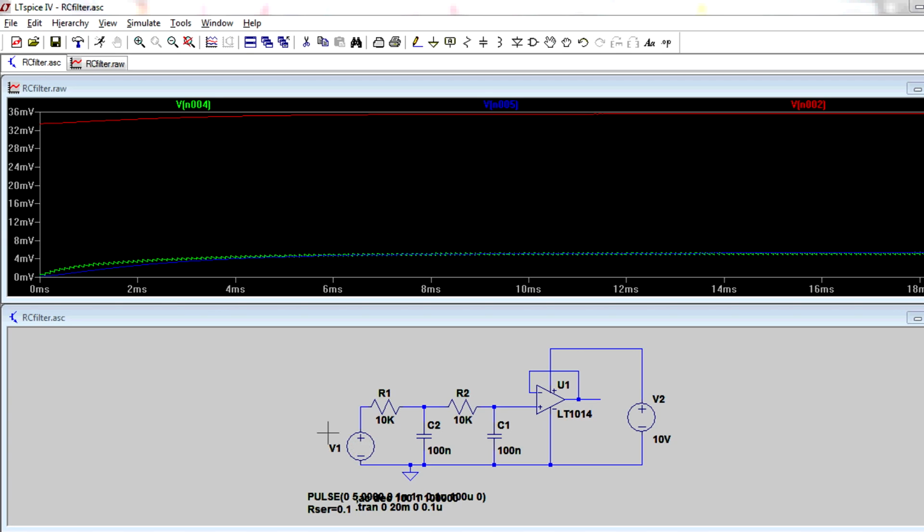So you might think that the solution to this PWM thing and the trade-off versus the response time versus the attenuation and the ripple and all that sort of stuff is to just up the frequency of your PWM signal. Well, yeah, in theory, that's great. The higher the PWM frequency you use, the easier it is to filter out with better response time. But the microcontroller is going to have a limit to how high a PWM frequency it can go based on the resolution. And generally, you can change the resolution of these things. You might be able to use it as an 8-bit one or as a 10-bit one, for example. And it's going to have a maximum upper frequency. You have to read the data sheets very carefully to get that sort of info. But generally, you want to run them as fast as possible.